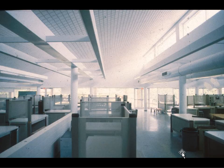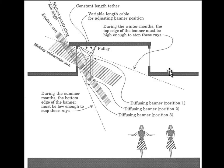We need to look at how we're using the space, because south apertures can also cause glare or perceptions of inadequate light when a cloud comes over. A nice combination is getting some bright warm winter sun coming in on the south side while mixing in some north glass. This is kind of what the teacher was doing — she didn't like the extreme variability so she added electric lights to even things out. North glass keeps some mellowness, reduces variability, but we still get the nice quality of bright light and warmth on a winter day.